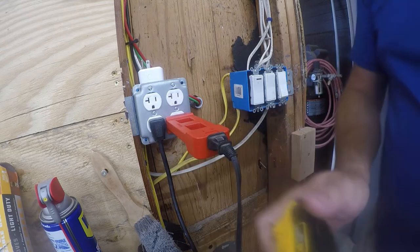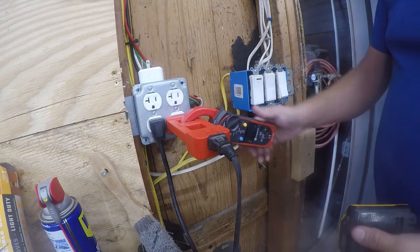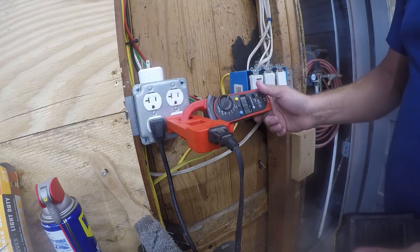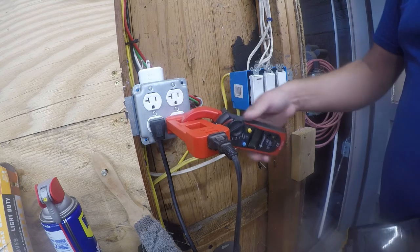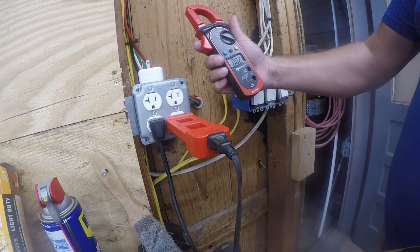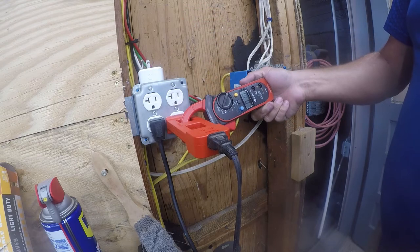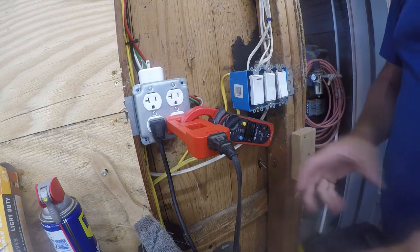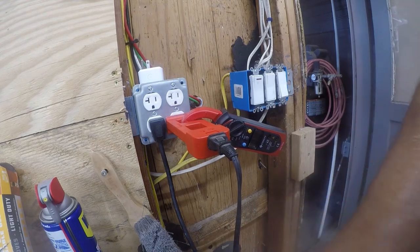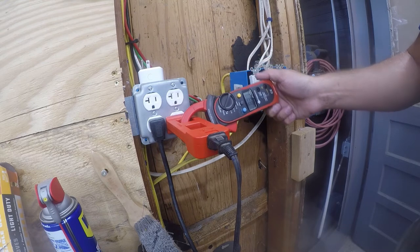I'm going to put the amp loop over the charger cord. One and a half amps isn't going to show up well on this meter in 1x mode. So just sitting here, this charger draws 0.15 amps on standby — a bit of an energy hog. When I put the battery on, it jumps up to 0.84 amps.